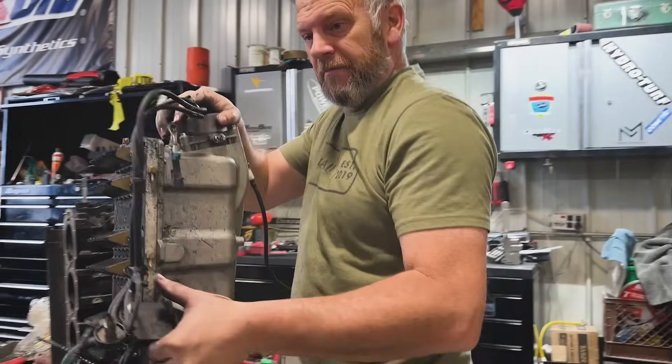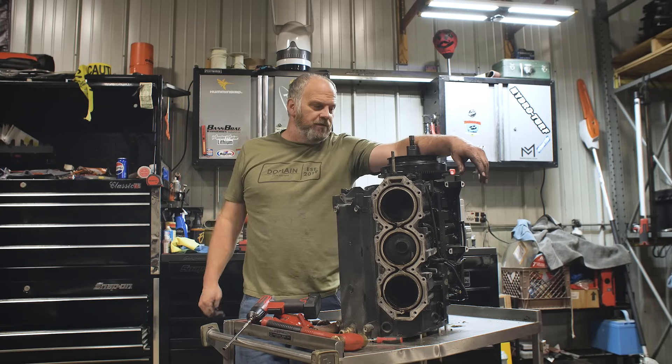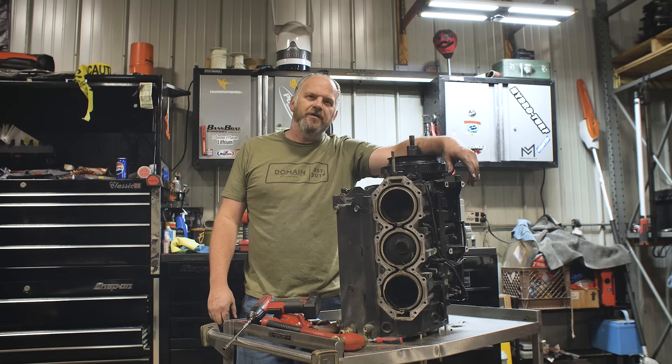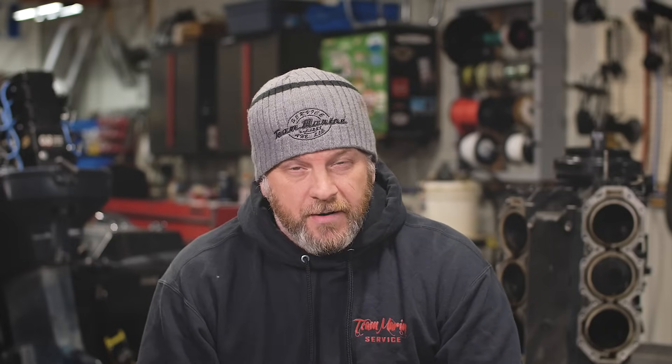There it is - as far as we can go until this thing decides to go ping on its own. It's stuck together, it doesn't want to come off. For any guys going to be like 'the washer's still in there' - the washer's not in there, I took the washer off. It's literally stuck together. Being that I can't get it apart, I can't really tell you what has failed, but it does look like there's definitely stick on the side - it doesn't look like your normal aluminum-to-steel transfer, it looks like steel-to-steel style transfer. So we could have bearing problems on this, could have anything going on.